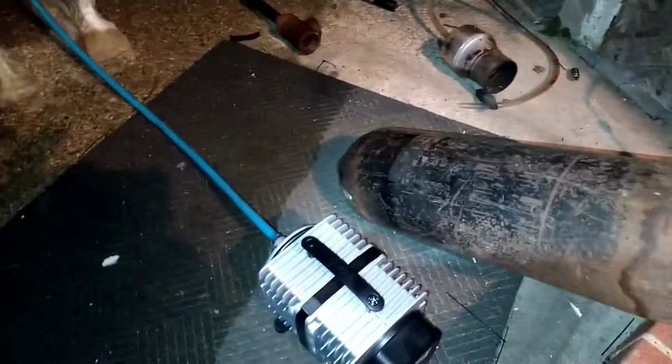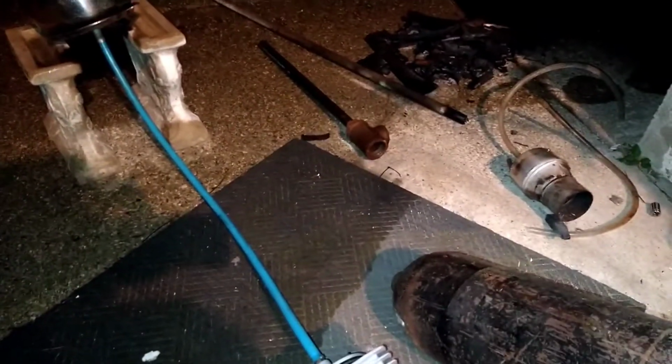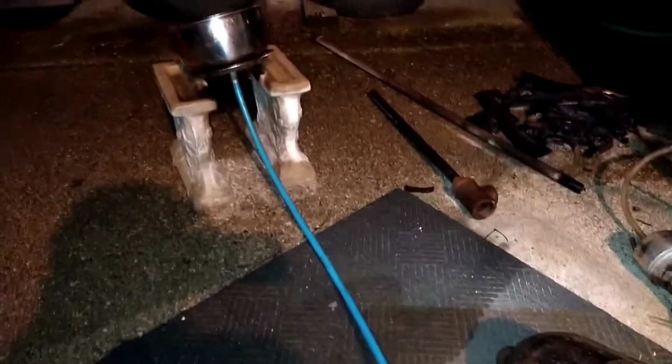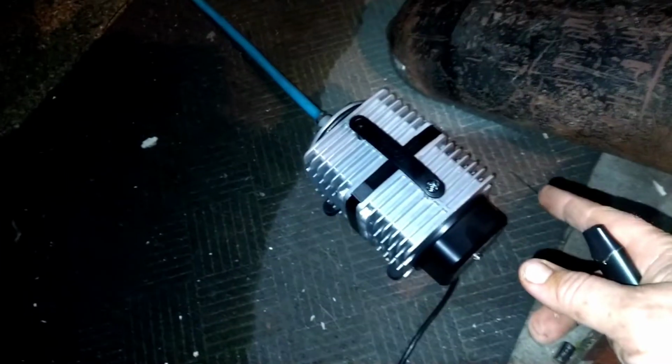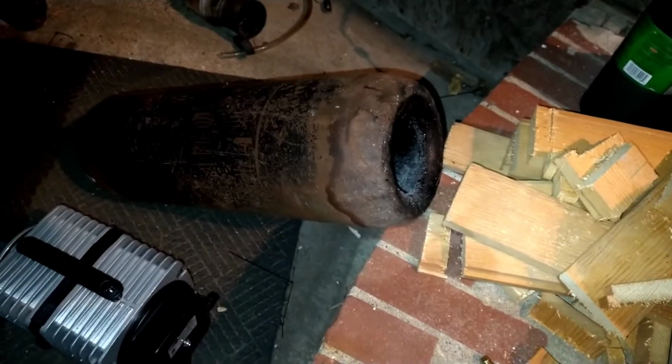So today what we're going to do, we're going to fill the burn chamber with this hardwood. We're going to put that stack on the top with the opening on the side, and we're just going to operate this and see if we can ignite the wood gas, and how hot this actually gets full out. This might be so much air that we get combustion, which isn't ideal. We want incomplete combustion, but even combustion is good, because it's good for another idea and invention. But the sand there is for sealing.